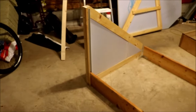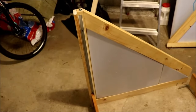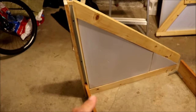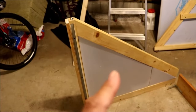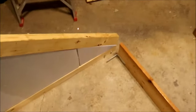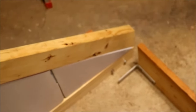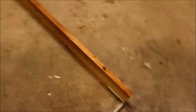We're in the garage to get out of the wind. These are the components of the cold frame. The construction is basically 2x4s — you see a 2x4 here, a 2x4 here, and the back is a 2x2. This angle is based on your latitude so that around noontime the sun is perpendicular to the 2x4 where the glazing is going to be. There's a bracket at the bottom, and the front board is going to connect to the two bolts at the bottom. That's the front of the cold frame — it connects to another side panel on the other side.